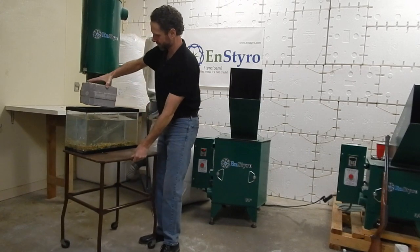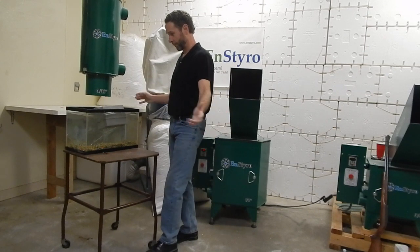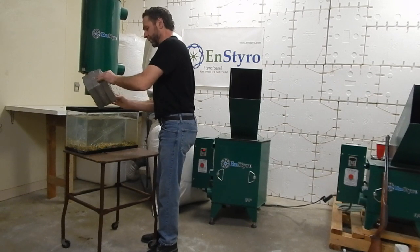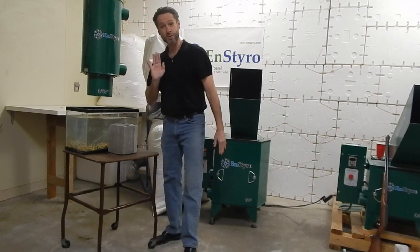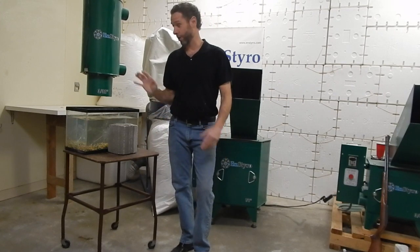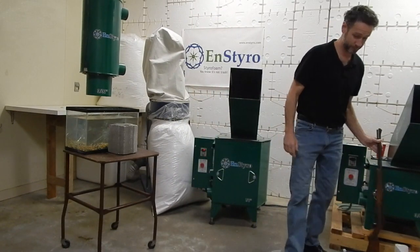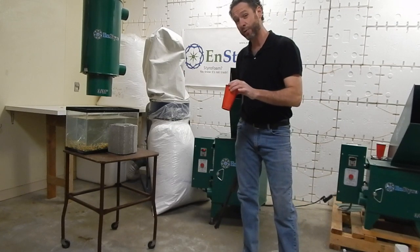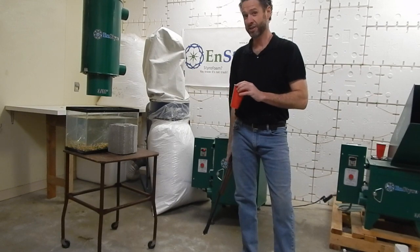This piece of concrete here floats. We have a floating piece of concrete — see that? Very nice. So a floating piece of concrete must be very weak, right? Not necessarily. If you make concrete the right way with a shredder and a separator, get the size range right, and do a good job making concrete, you can make it very tough with styrofoam. The nice thing about styrofoam is it's moisture resistant, lasts forever, and it's almost weightless. It's a really unique concrete aggregate and it's very beneficial.